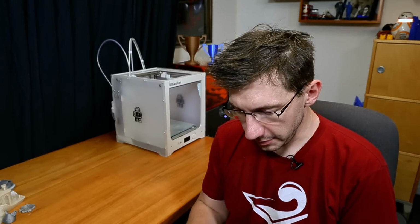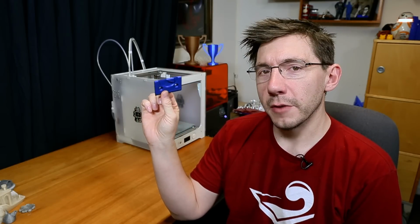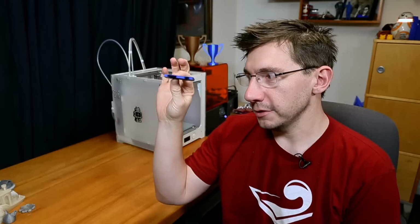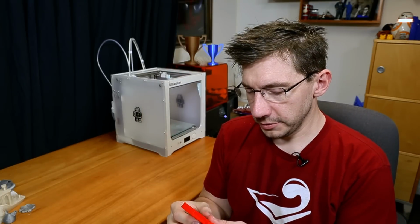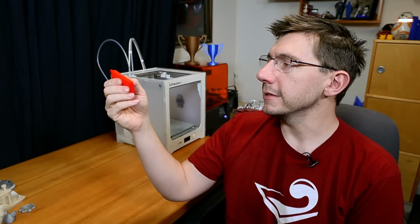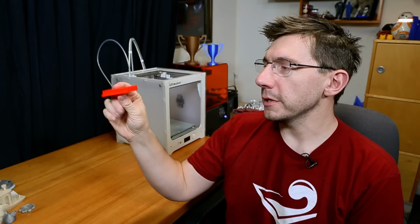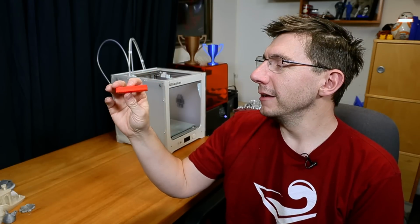Now that the model is done and printed, I can kind of tell you about what happened there. This was that test that I did where I didn't set the zero on my calipers correctly and everything was a little too thin, so that didn't work out too well. This was the piece that I printed and it had that piece on it right there. That was where I had to extrude this a little bit taller after I fixed the issue with my calipers.